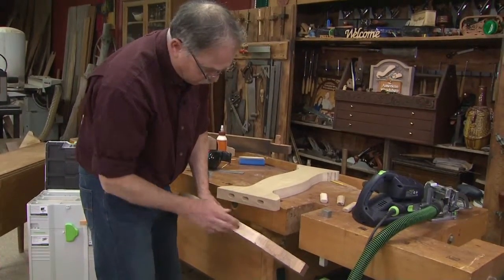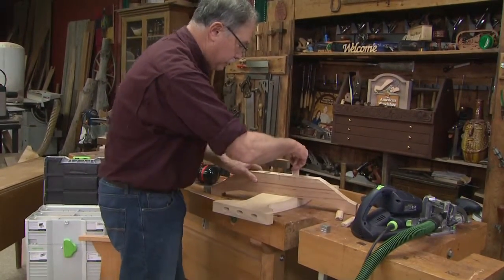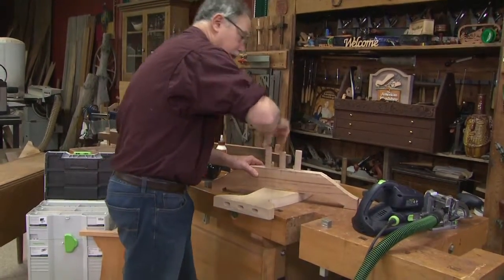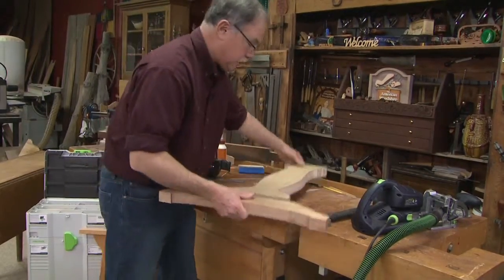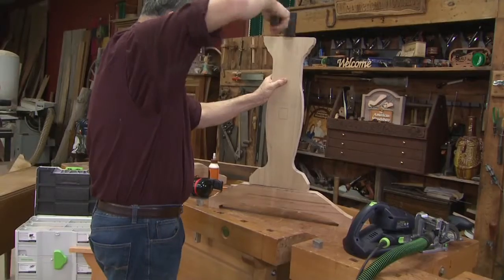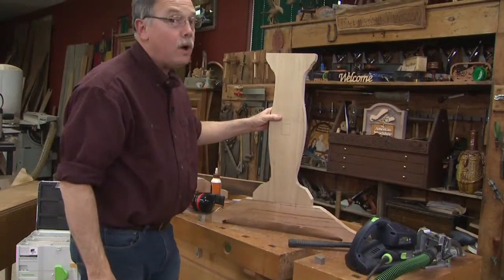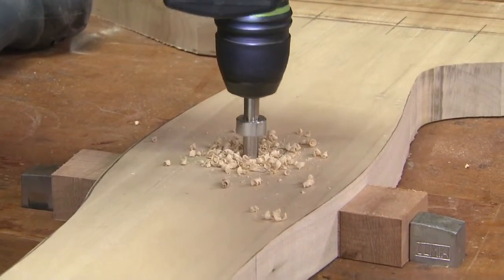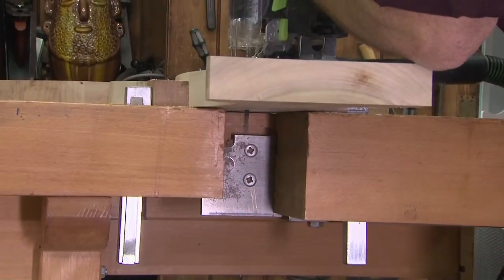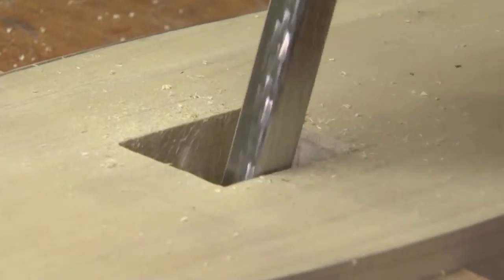Let that come to a stop — that certainly is a simple way to make these mortises. I'll do that for all of them. You can see the holes in the milled faces here that create a perfect joint. The moment of truth is to insert the dominoes right into the mortises — those are loose tenons. That was just the first fit, the test fit. That is a perfect joint. Once it has good yellow wood glue in it and cures out, there's no way that will ever fail. Now I need to bench dog this so it's secure, then drill a pilot hole in the middle with a three-eighths inch bit, and use a saber or jigsaw to evacuate to the cut line. A little work with that microplane and it will be ready for the test fit.